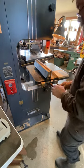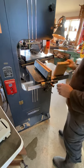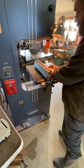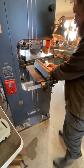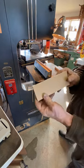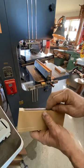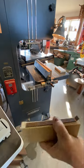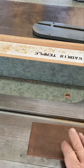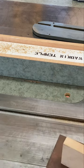Making it to push something this thick. There it is — this is a little setter so now I can push something that thick on the table. The blade is tipped to 45 degrees and is in a zero clearance throat plate. My push block will support it over that.